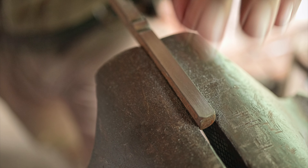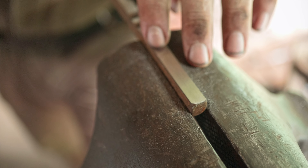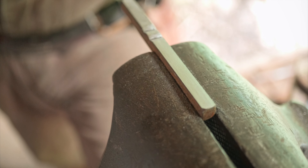Draw filing is really good for when you want a really nice looking surface, but it's also good for bearing surfaces and moving parts. If you have a part that slides, this makes a really nice bearing surface.